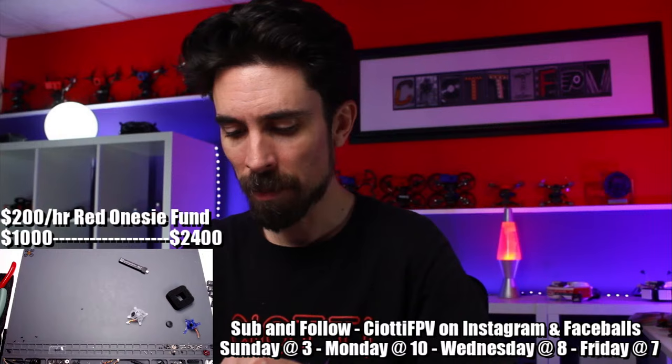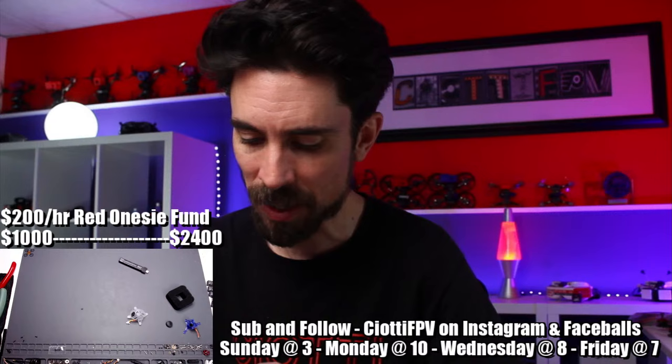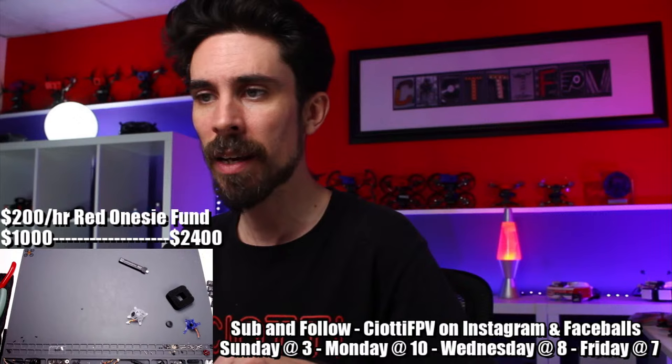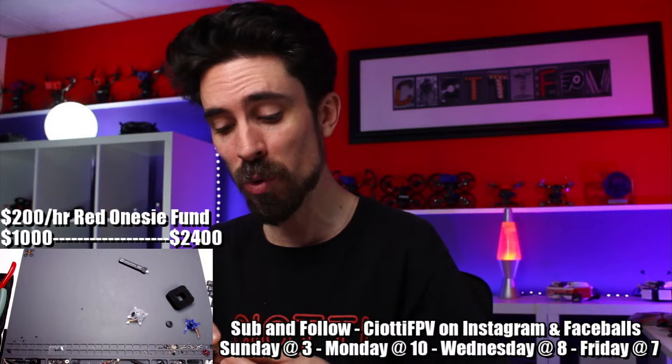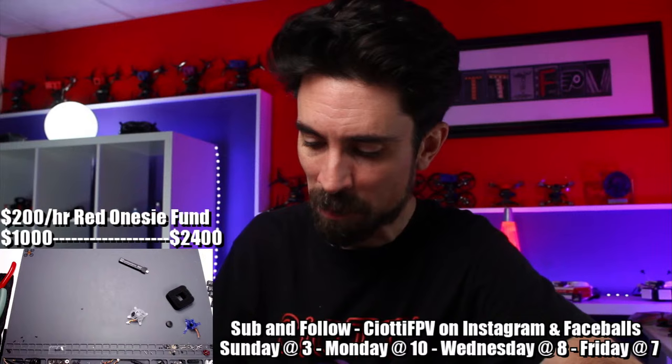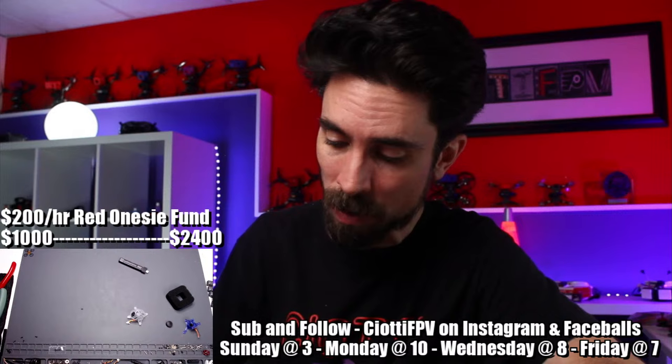I was not aware that they did multiple different sensors. Do you know anything about that? Does anybody know anything about that? I know that there is a camera that looks very similar by Flywoo, but it doesn't have the little screw holes that we need to mount it into the Mobula 6 canopy. So don't get suckered in by that and buy the Flywoo version. It will not work. You will not be able to mount it. You'll have to find some other mounting solution. They do make a McStinky canopy for the Runcam Nano 3, so you could run it in there.